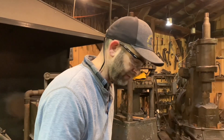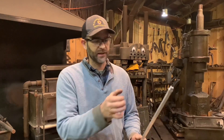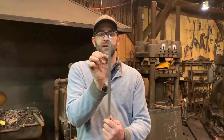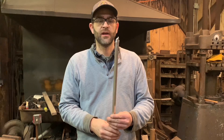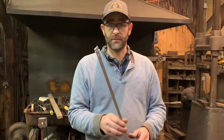You can see that the material just fragmented — it just split into pieces. There are chips all over the anvil and all over me. It wants to fracture, it's just lost all its structural integrity. Don't overheat it — that is the key. Keep checking with the stick, be patient, get it up to a dark brown color with the stick, not black but a dark brown. It's not like iron — it's not as forgiving. If you fuller this really tight in aluminum it's going to create a weak spot where the material wants to fracture. It's easy to pull out a simple taper and form a scroll, but beyond that you're not going to get away with as much as with iron, but it is a fun material to forge even though it's a bit challenging.